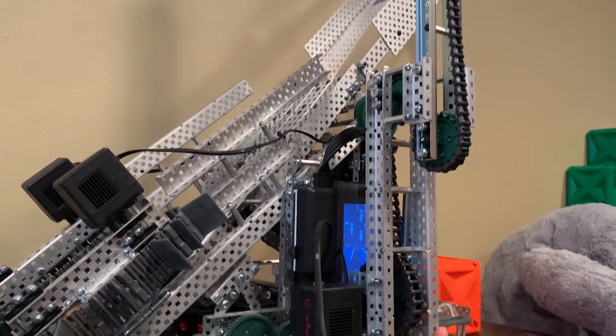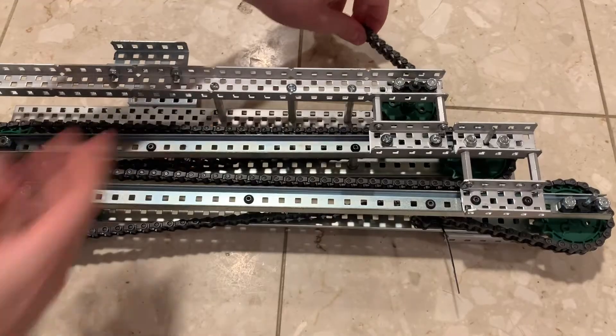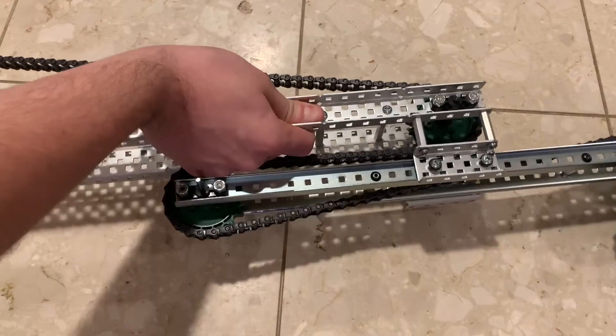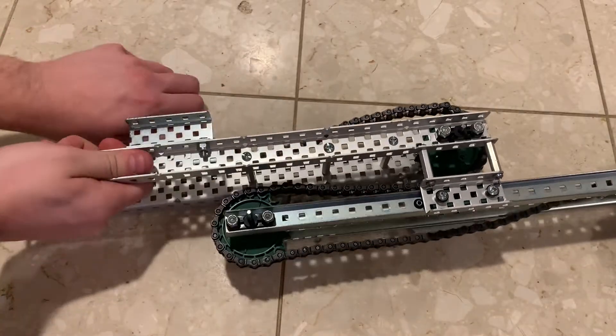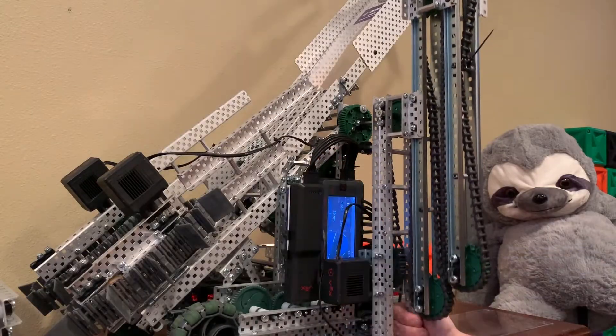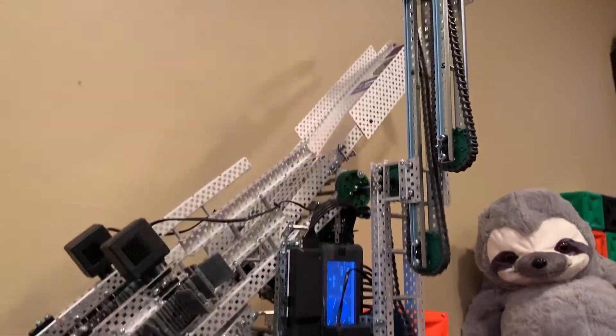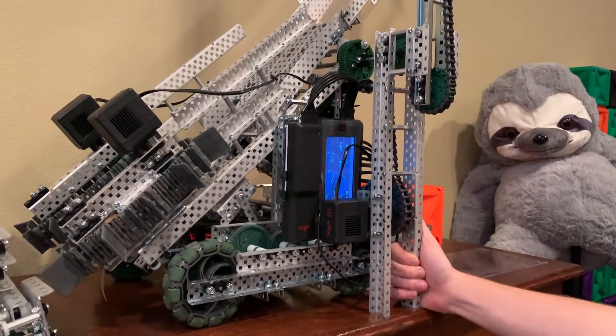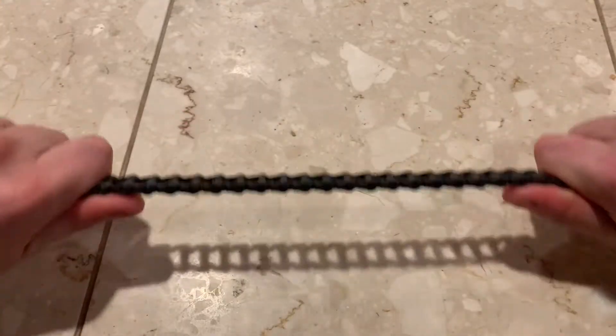So let's talk about exactly how this mechanism works. The basic gist is that when the chain at the base is pulled, it pulls the chain tight, and the only areas where the chain can get tighter is between the stages. So it pulls the sprockets closer together, and thus pulls the stages upward. There is a theoretical limit of 50 pounds on this chain according to VEX, but I find it to be much lower than that. You could fix this by using multiple strands of chain to spread the load, but the easiest thing is probably to prevent the chain from having any twisting ability, as that's the easiest way to break this chain.